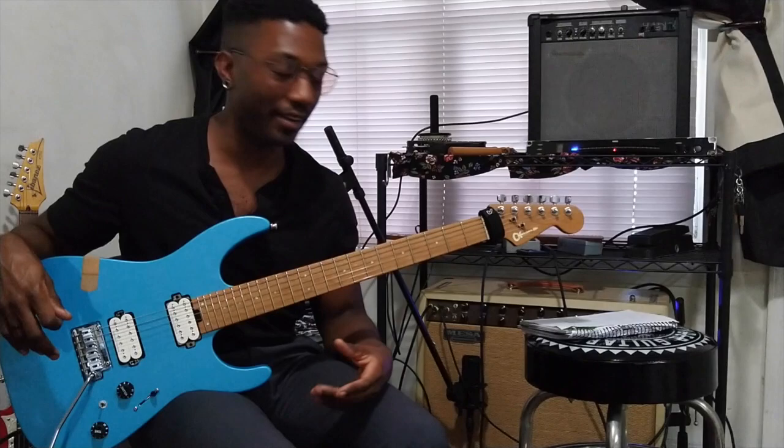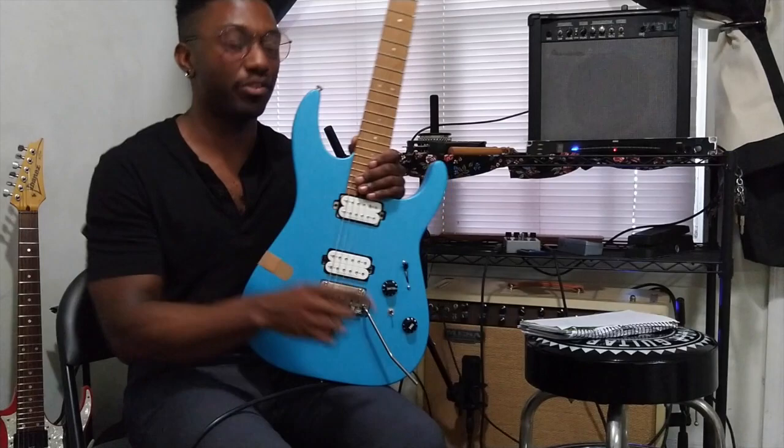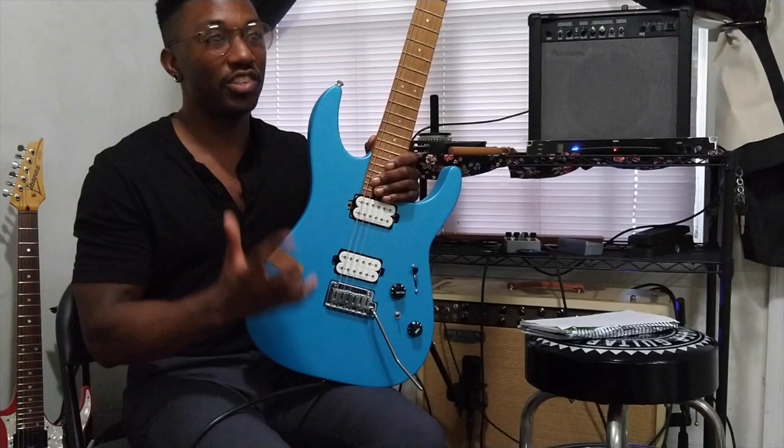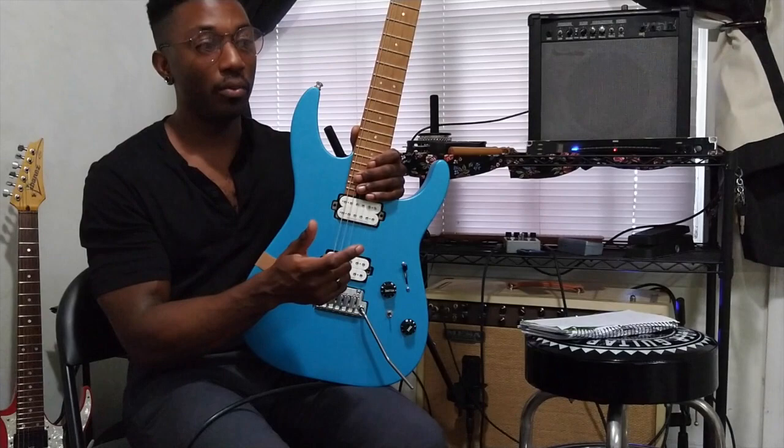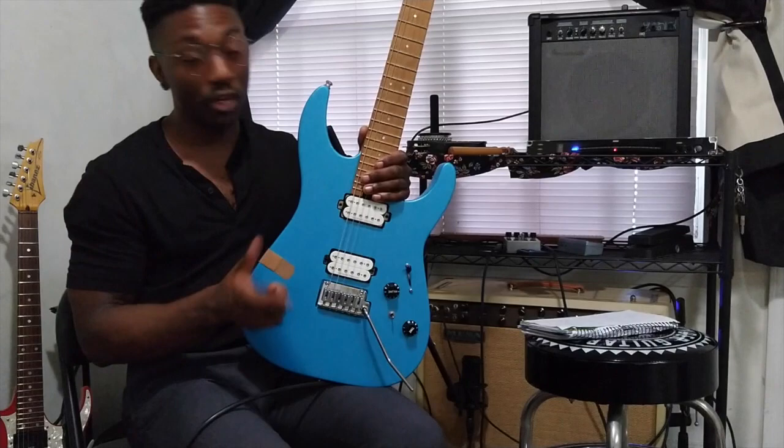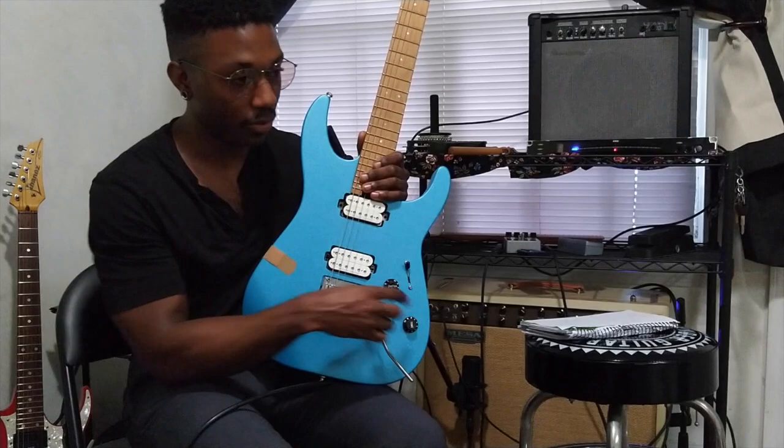We also have a no load tone. When it's at 10, it's almost as if it's removed from the circuit, so you get a little bit more presence, a little bit more full spectrum to the signal, to the tonality, to the timbre of what's coming through. It's hard to describe, but there is a difference between having a no-load tone pot of the same value with the same capacitor and just having a normal pot wired up. The best way to describe it is a normal pot on 10 is like having a no-load tone circuit on 9. Okay, let's go through some switching.